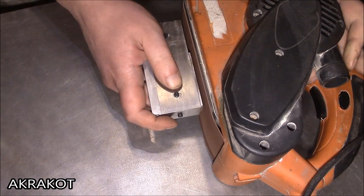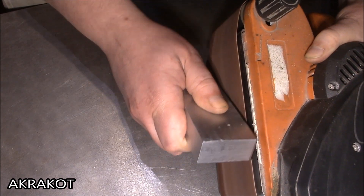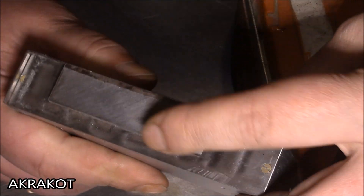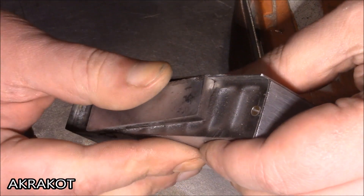The magnetic lock is ready to work. This simple device will not allow your hand to get on the grinding surface if the part pops out. During grinding the part heats up very much, but the massive aluminum body takes away heat so the part does not overheat and the hands are not threatened with a burn.